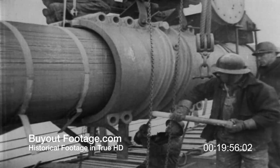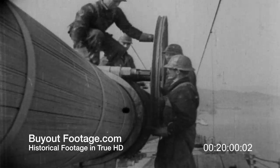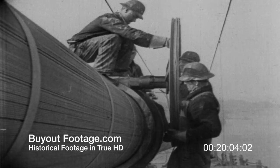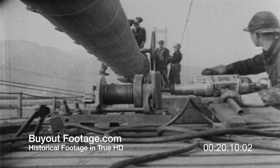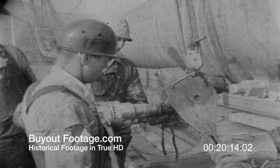Cable band castings are made in two halves, which are clamped together tightly by means of bolts, and the friction thus developed prevents the bands from sliding downhill. The nuts are first taken up by a large wheel wrench turned by a drive rope around its rim.